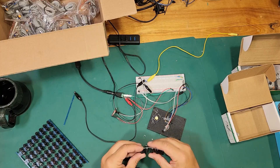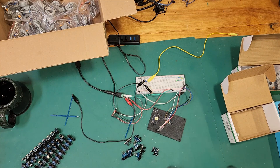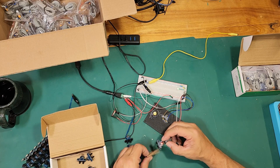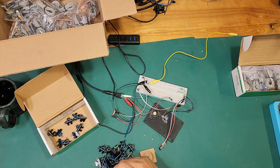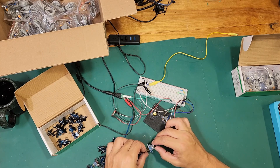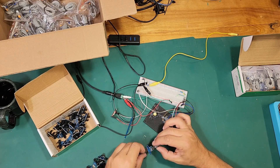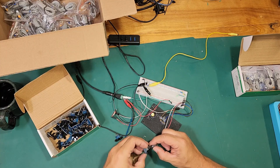Here I'm processing and testing all the optical sensors that come from the factory. They come in a big batch and you have to separate them all. I built a little test harness to quickly test each one — on the breakout board in the top corner there's an LED that shines green when it's actually receiving a signal. I plug each one in, interrupt it, and make sure it's working. Unfortunately I find about one out of 15 or one out of 20 sensors in these batches don't work, so I want to eliminate that headache before it reaches you.